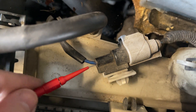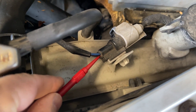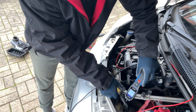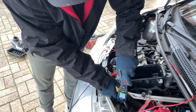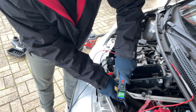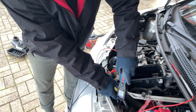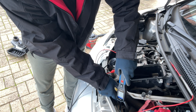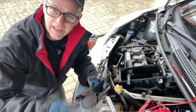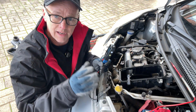If I pop that into the black side of the wire we can check the earth as well. We put that in there and just touch it - see how the screen's gone green and it's showing a zero. We can also do an ohms test: just touch that on there and it gives an audible beep and tells us we've got zero ohms. So that's a perfect ground.